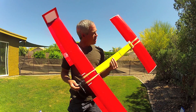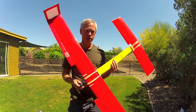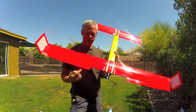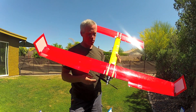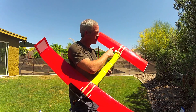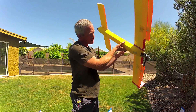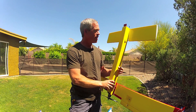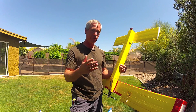Depending on how equipped, this plane could be built at about 900 grams just for a fun flyer with one or two 2200 milliamp-hour three-cell packs, up to about 2000 grams as my maximum recommended weight. It has only two elevons, so two servos, very low current draw, and very simple to hook up when the wing is mounted. I've designed this as a belly lander — it's very easy to grasp and hand launch. I experimented with some landing gear and it was kind of a mixed success; the additional weight and complexity was not really worth it, so that would be up to the builder's discretion.